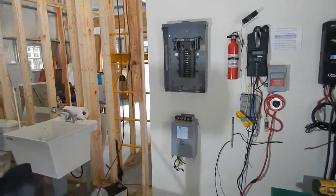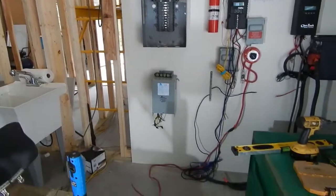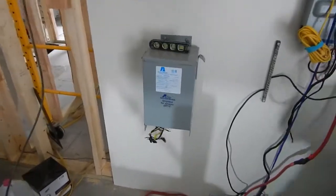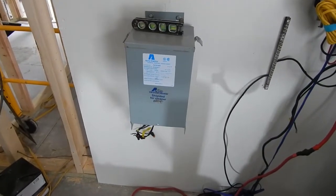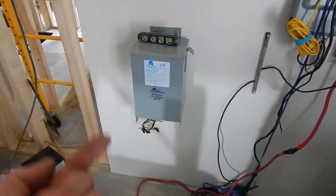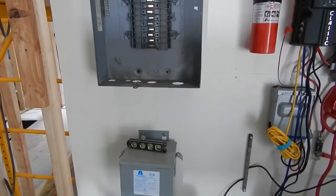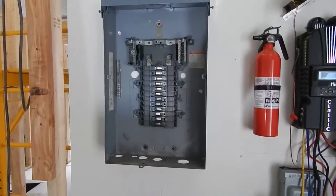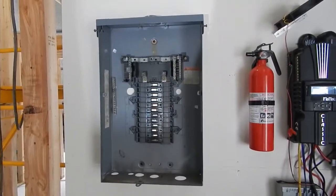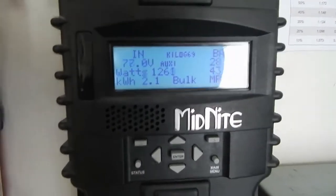The main panel here is up on the wall and is only going to have a couple of items. I'm trying to get my well pump running. Down here is a 5kVA Acme transformer that's going to take 120 volts out of my Samlex power inverter. 120 volts comes in to the bottom of the transformer and comes out split-phase — 120 each side, totaling 240 volts. We'll hook up one leg to each side of the panel, and I'll be able to run my well pump without starting a generator as soon as I hook up my solar panels.